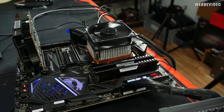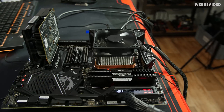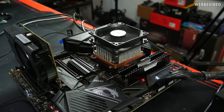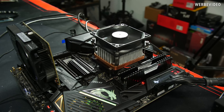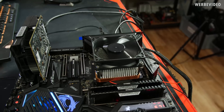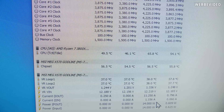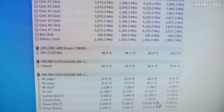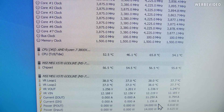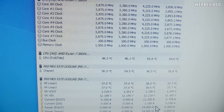The system is up and running. For now I haven't connected the TEC module — first I want to test the cooler itself and check for any mounting issues, since there could always be something preventing perfect contact between the cooler and CPU. Looks quite nice. Checking the temperature at idle, the Ryzen 3800X is running at somewhere between 50 and 60 degrees Celsius. I think for the 3800X that's fairly reasonable, and now it's time to connect the TEC to the PSU and see how things change.